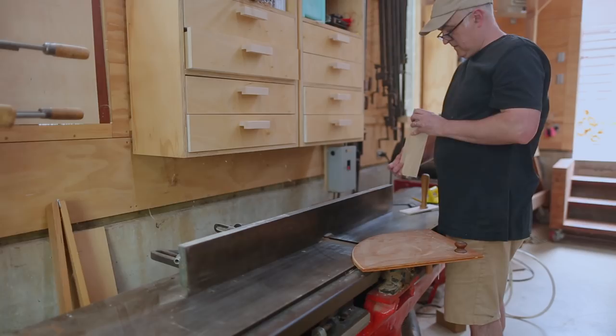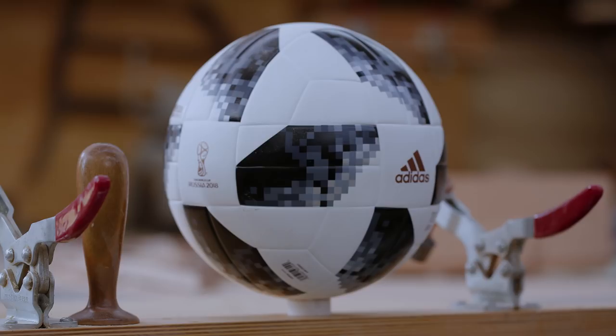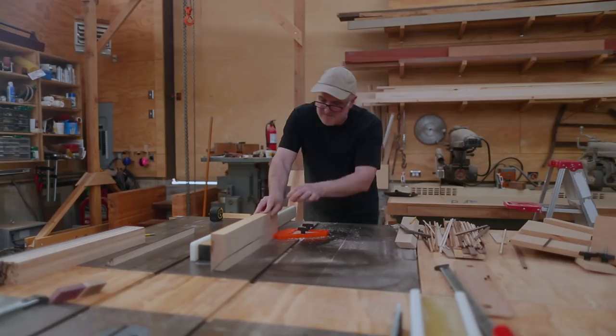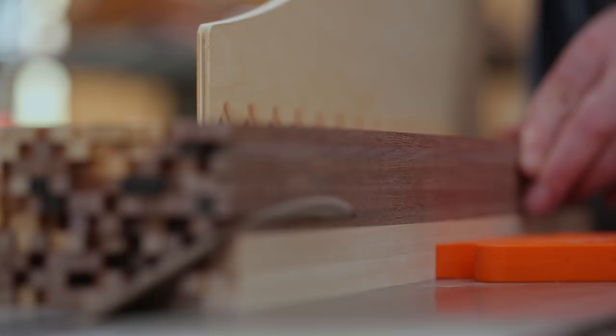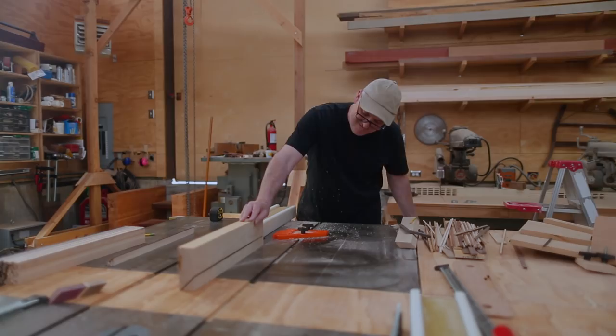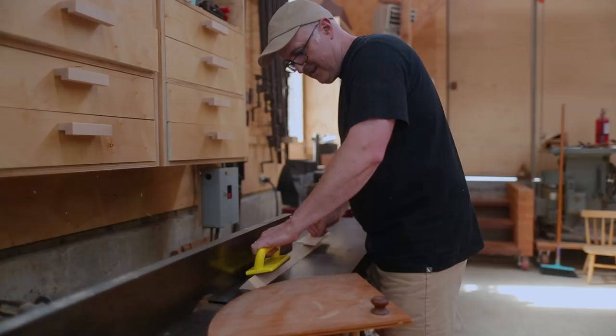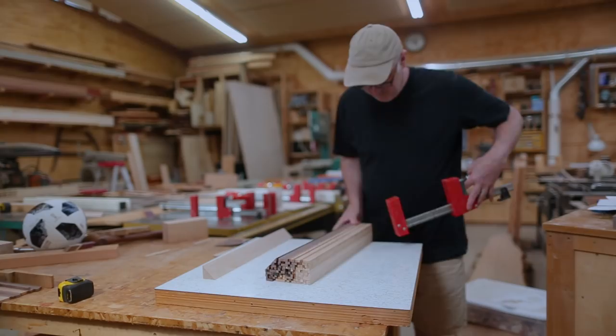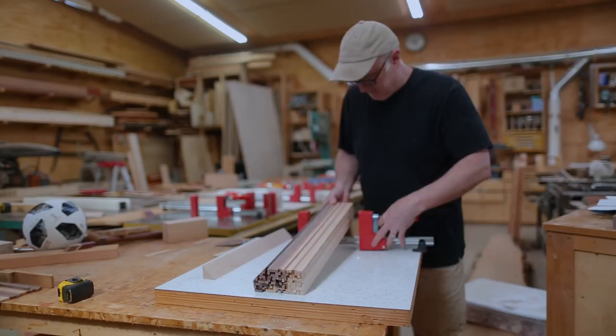Now part of the patterned piece gets cut off — there's a corner that's going to be solid maple, so I can cut off that corner. I can make the piece that's going to fill that corner, and the rest of this piece of wood will be part of the third section of the ball, so it's not a waste. I can joint that face — this cut didn't seem to be the straightest, but this worked really well. That'll get glued and clamped to the corner of the pattern piece.